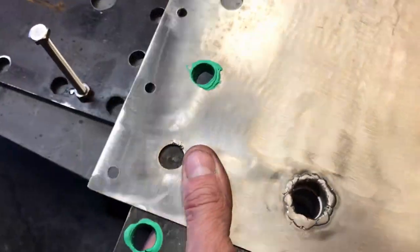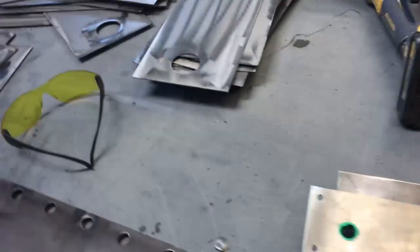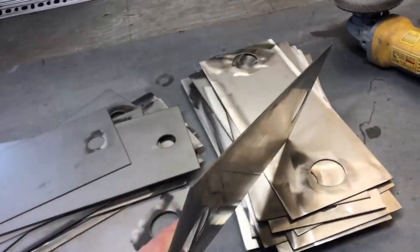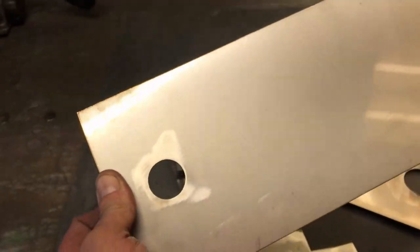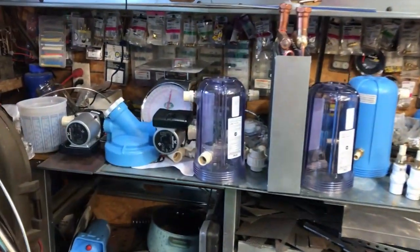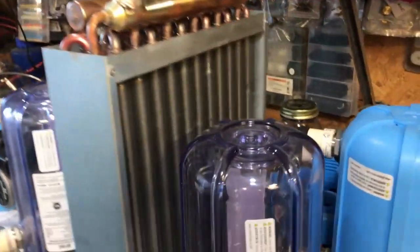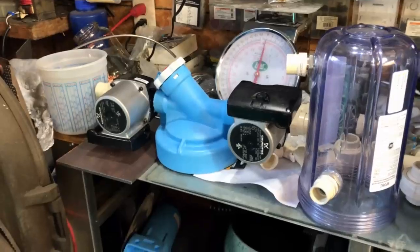As you can see, there's the plastic constituent of the CPVC connector — we have two of these, the other one's outside drying. Here are the plates we're going to be using; these are 16-gauge. These are the inner plates with the smaller electrolyte channel, and here are the gaskets. There's 90 gaskets there — we're not going to start with all 90 plates. Over here is the rest of the equipment: a radiator, a couple of electrolyzer tanks, a bubbler, and the pump system.